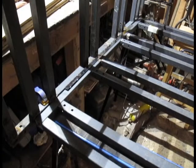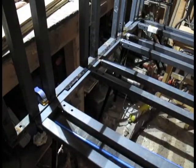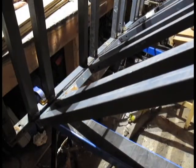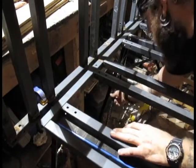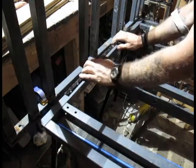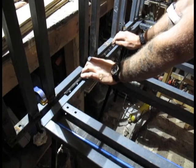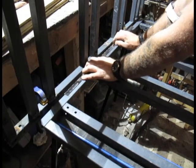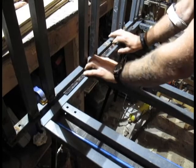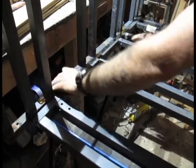This is more or less how it's going to work together. The bikes will roll in here, front tire first, and then this whole piece will fold up and hold the front tire in place. I've got a two-foot length of piano hinge here and we're just going to line this up by eyeballing the center, then drill a couple or three holes and rivet this in place.